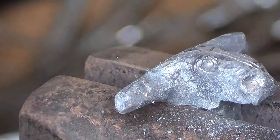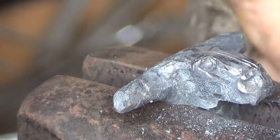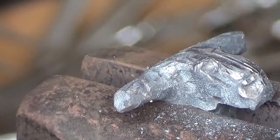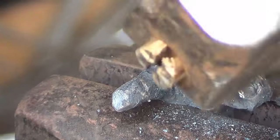That's where you can make the bull a happy bull or an angry bull or a sad bull depending on where you go. You don't need a lot of heat to make that happen. Next thing I do is take the peen side of my two-pounder and just kind of add some random texture all over the piece. What that does is it softens those chisel lines and gives it a sense of depth. I might go a little heavier down the nose to help put a bit of a separation in there and soften that up.